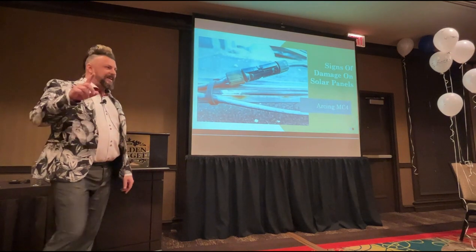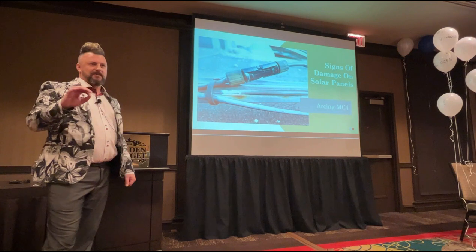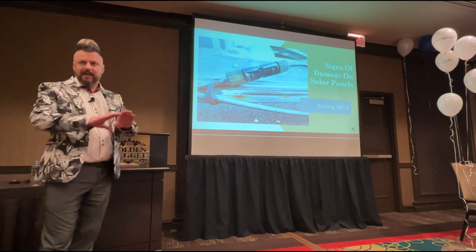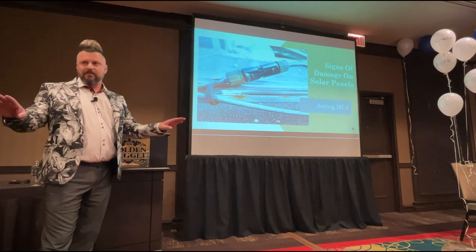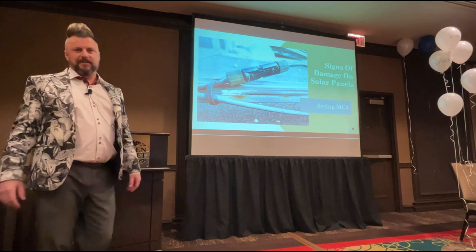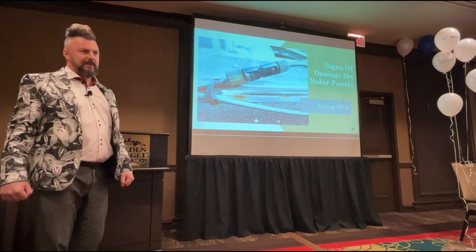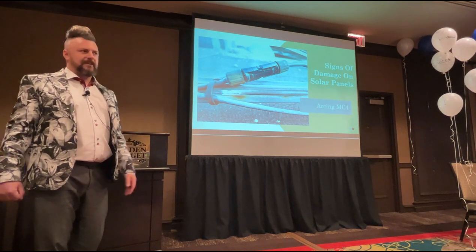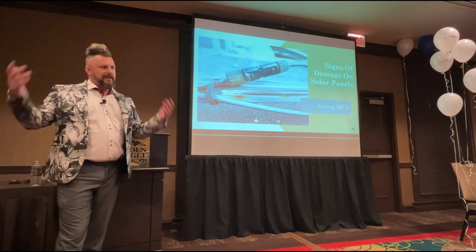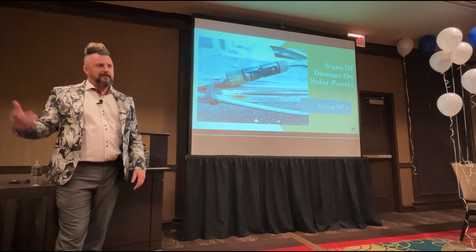That, by the way, if you're getting into panel cleaning, is a great source of revenue. Always look under the panels, and if all those MC4 connectors are hanging off the rail and they're all resting on the roof, photograph it. Mr. and Mrs. Smith, all your MC4s are resting on your roof. Not supposed to be like that. Do you want me to do it now while I'm here? Yeah, great. I can either do it now and it's going to be half price, or I can come back another time when I need to bring all my team again. It's going to be double the price.